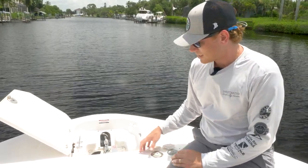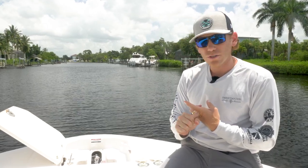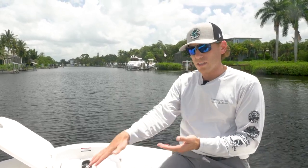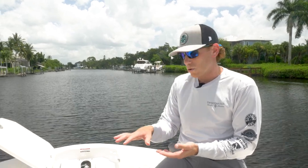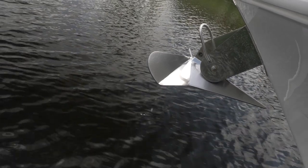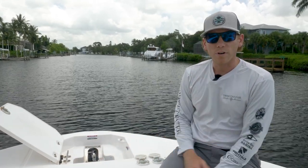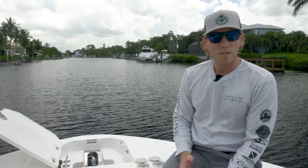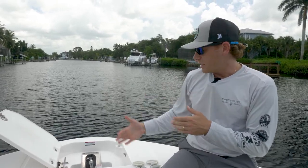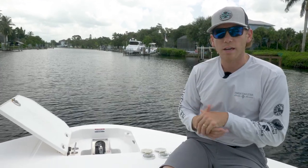Make sure everybody understands you do not want to get your fingers anywhere near this mechanism — you will have an injury. We have had a few. On a couple of our boats — Ms. Haley 2 (the 272) and Ms. Madison (the Regal 290) — the anchors do come back quite a bit upside down in the mechanism. Just take a peek over the bow as it's coming up to make sure it's facing the right direction. They have an auto swivel, but it doesn't always go the right way, so you may need to lower it a bit and bring it back. This helps prevent damage to the boat and damage when docking. If you have any questions on windlass anchoring, ask one of our captains at the dock — we'd love to go over this dockside and take you out to practice dropping anchor. We've been having issues with losing anchors, lines breaking in half, and safety concerns, so please ask any of our captains with any questions.